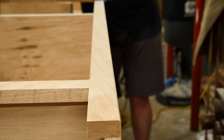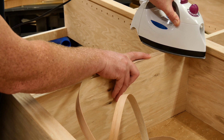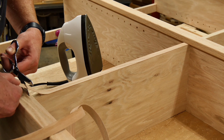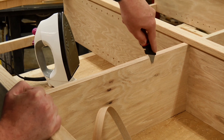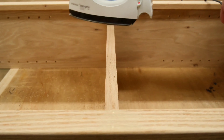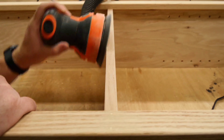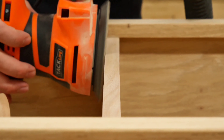After that, I began applying all the iron-on edge banding to the fixed middle shelves. I've used this stuff before and I really appreciate how easy it is to apply. You just set your iron to the cotton setting and then use it to push the strip onto the edge of the plywood. You then cut it down to size and trim away all the excess using a utility knife, or they actually make a special tool to do this. I've actually found that it works better if you don't trim all the excess away so it's completely flush with the sides of the plywood. If you leave a little bit extra and then use an orbital sander on the edges, it blends it seamlessly between the edge banding and the plywood, meaning that you really can't even tell that it's there. It just looks like a solid board.